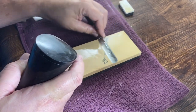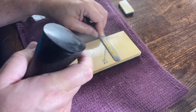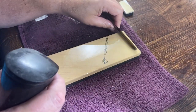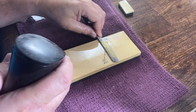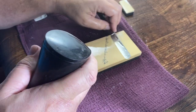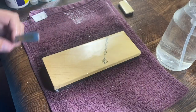What you'll notice is I'm doing very light pressure, and I'm waiting for the blade to stick — it's already starting to stick. You can actually see it because I'm literally putting no pressure. You can see it's starting to chatter across the coticule. It's sticking really nice now. I'll wait for that final stick when I have to almost put pressure on it to move through the water — and that's getting to that point now. And there it is.